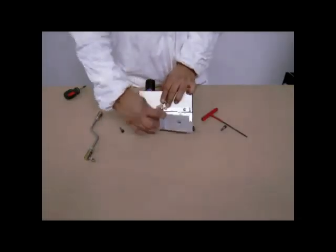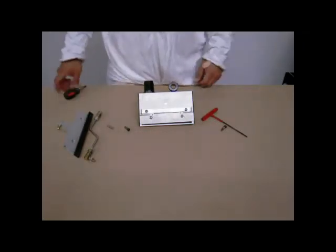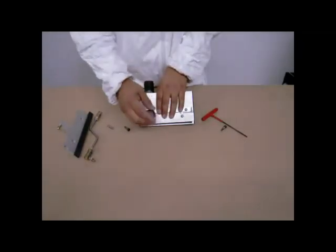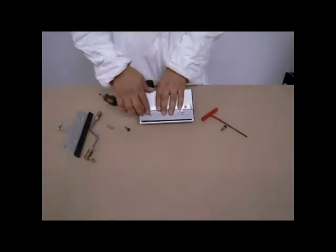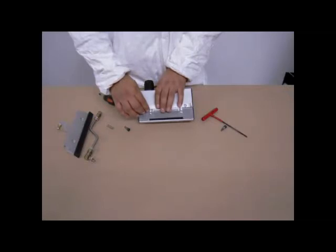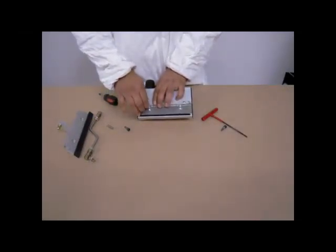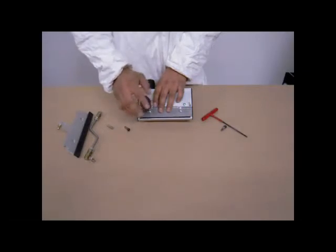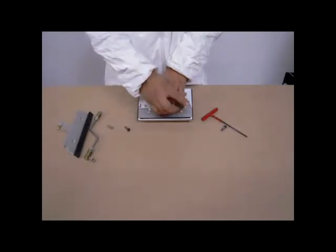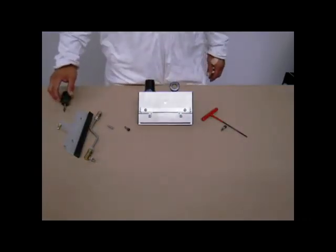When removing the door, be sure to secure the door spring as it may fall away. Next, using a Phillips head screwdriver, loosen the machine screws that secure the adjustment plates. The inside plate adjusts the width of the line from 6 inches to 4 inches. The outside plate adjusts the amount of beads that flow. The bead dispenser is factory set for a 6-inch line and a 50% bead flow.